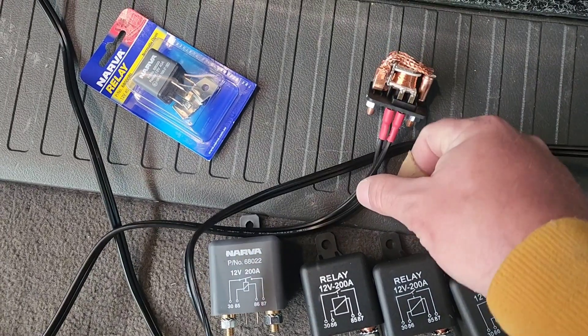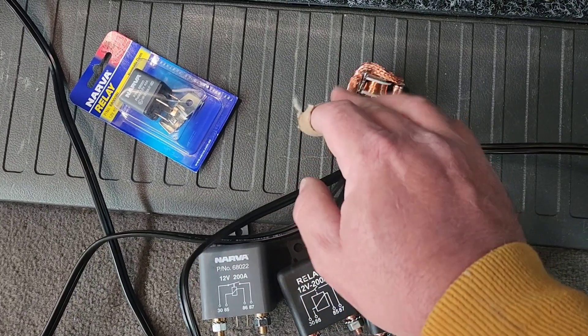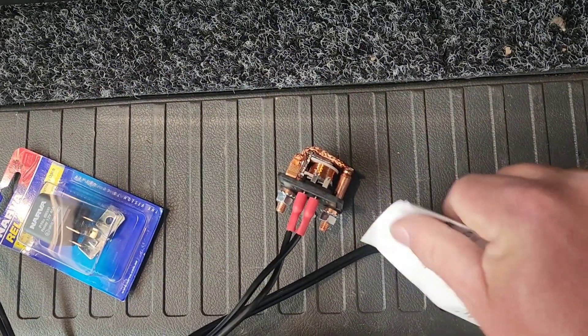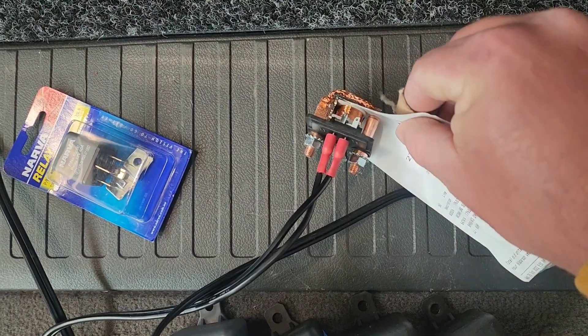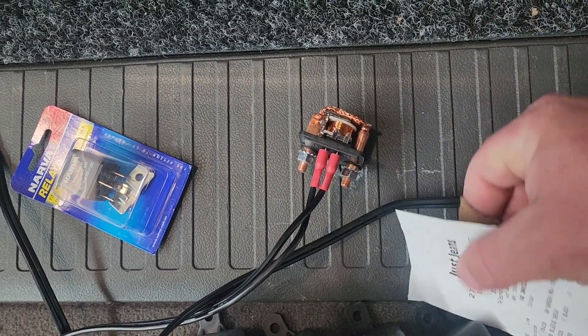You'll see why they won't work. We've got a basic setup — 12 volts to the coil, the coil energizes and closes these contacts. As you'll see, if we plug that in — see, that's now plugged in — we have a nice big gap in the contacts, and that'll be why it's not working.